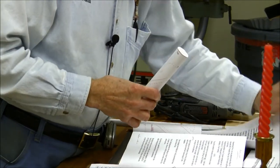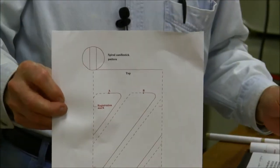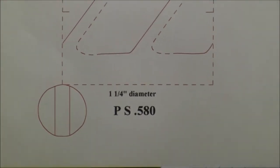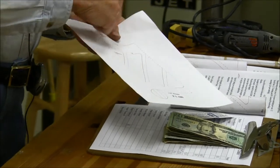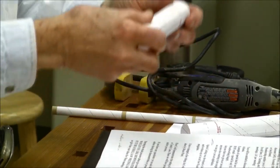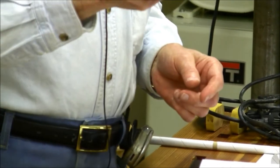The pattern may be a little hard to see because I like to work with red and green patterns. I find it easier on my eyes to cut with green or red lines than black lines. You cut that pattern out all the way around, including those little round circles on the ends, and leave them attached. Then you wrap it around your bar and make sure those lines come together when you match it up. That folded-down end is what you line your blade up with on your saw.